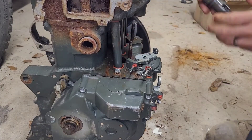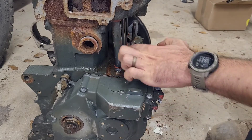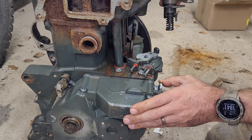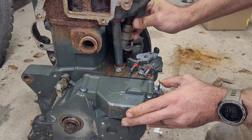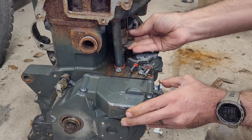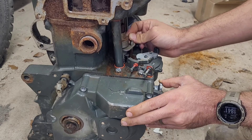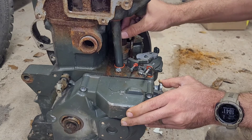I'm not going to tie it off for instructional purposes only — and keep in mind you're supposed to have some shims in here — but this will only go one way, and this ends up covering up that hole. So this will be tied off or you hold it. Your incoming fuel needs to go between there so you can kind of get it started and get it in place. It's not easy to get in here; it's going to fight you quite a bit. Then holding it over, make sure that the little tab is all the way over to the left and work its way in — and see, that went right in.